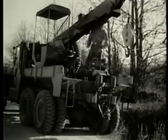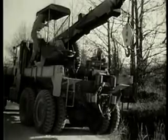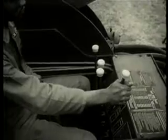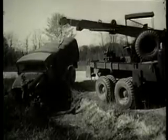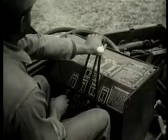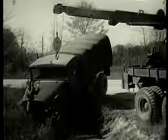As the situation requires, the boom may be swung to the right or left. In this case, pushing the boom swing control lever away from the operator, it moves to the left. By pushing the hoist and crowd control levers away from him, the boom is extended, and enough hoist cable is paid out to prevent damaging the boom.